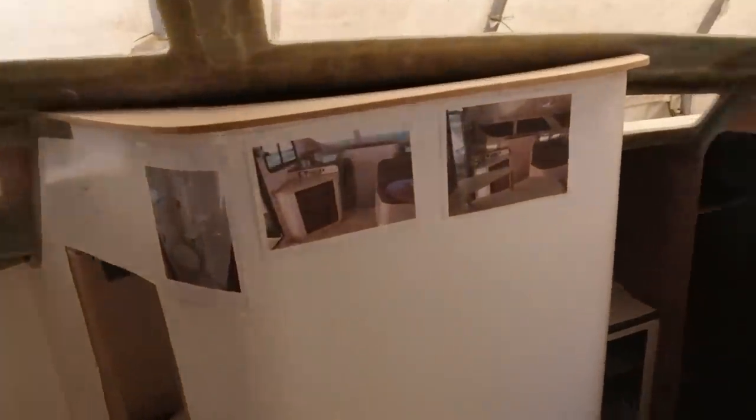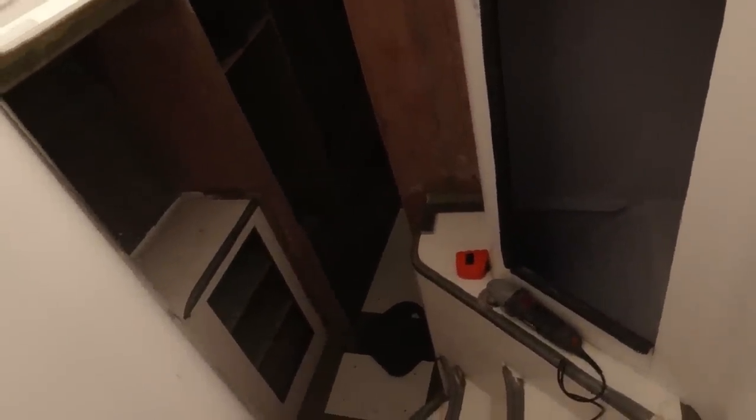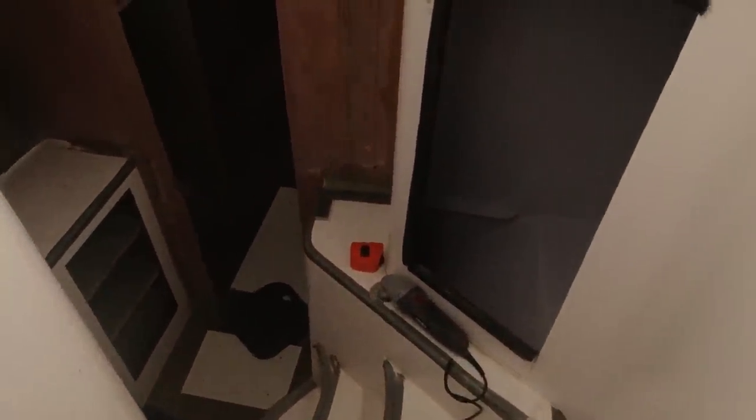It's okay to have all these wonderful conduits but having access to the entry and exit points is now the key. If you haven't got that access you're in trouble, because you're going to be reaching into very long and narrow compartments trying to feed bundles of wire. I've got a lot of conduits but I've got to make sure I now have access to them. Over the last few days I've been cutting out access hatches in the floor to run all my bilge pump and plumbing, but the bilge pumps all have to feed back up into this section here and to their respective fuses.